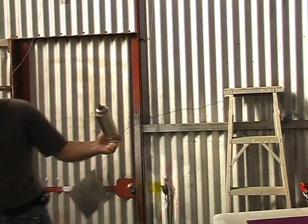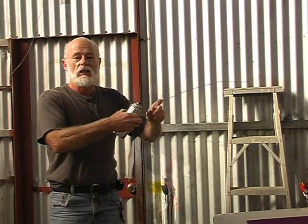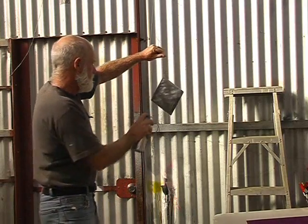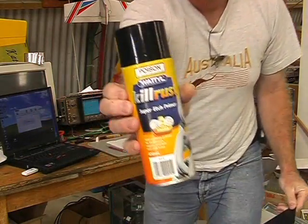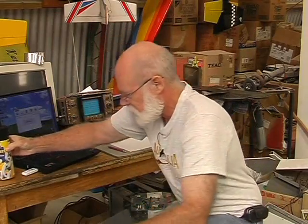Before I paint this I'm going to take my glasses off because otherwise you end up with little black spots all over it. I'm using black paint because it gives the best contrast when you're actually doing the next step, which is scratching your pattern into the metal. Now we have our painted piece of spring steel — painted both sides with etch paint. The key words on the can are 'etch primer' and it has to be one that's suitable for use with steel. I've painted that, it's now nice and dry the next day, and I'm now going to mark out the shape of the reed valves I want.